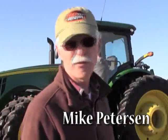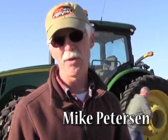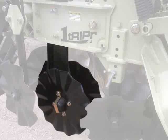What we're doing here this year, we're fall strip tilling. We're going to come back in with soybeans next spring. We're going to use the new inserts with the wavy coulters that fit in instead of the shank — we pull the shank out and then we put the inserts in. There's also a new shank that will fit right in between those two wavies. We'll be able to fertilize with liquid, so we can put down our phosphorus or potassium liquid product next spring.